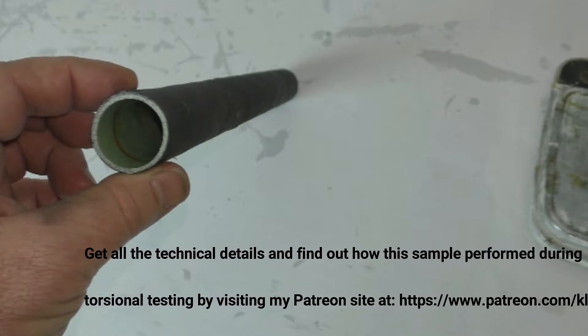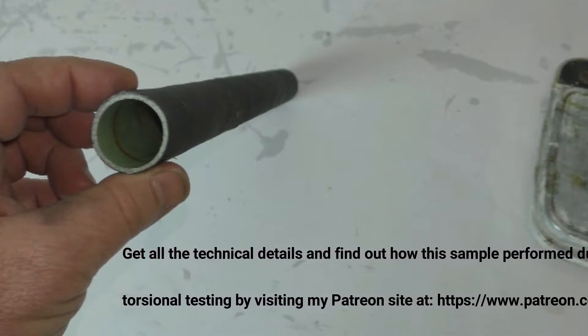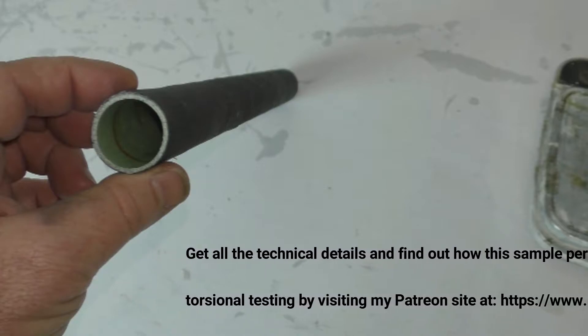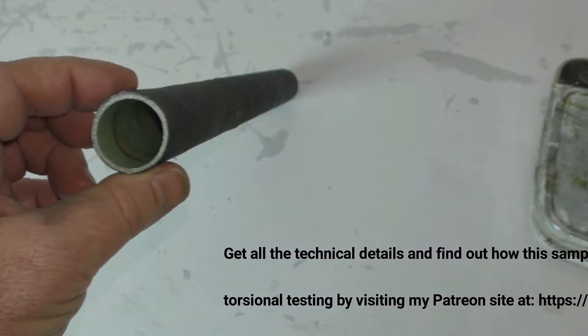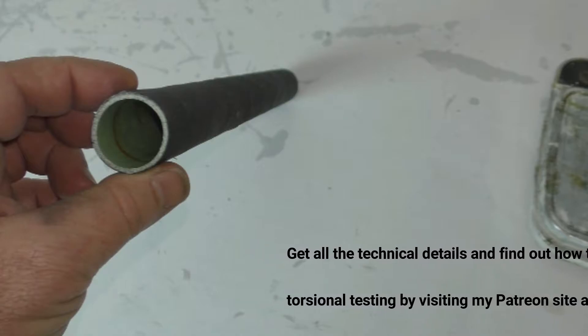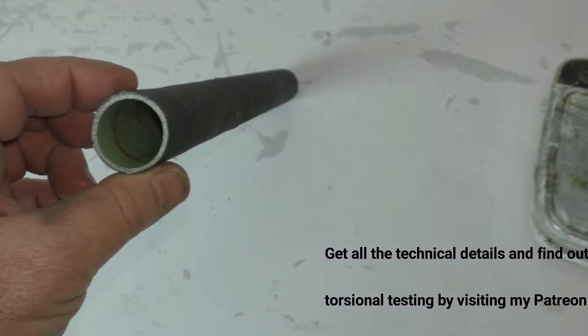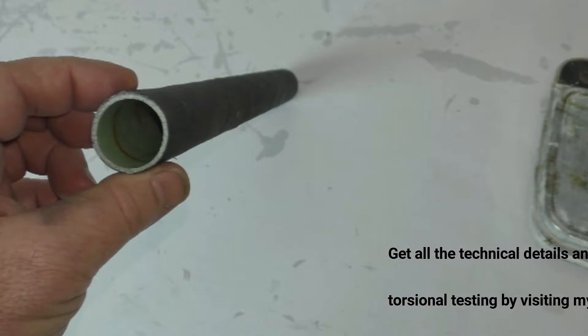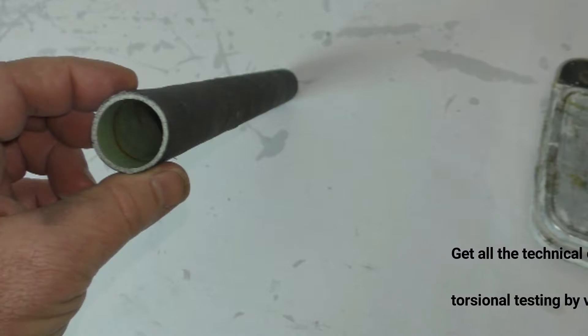In the fast-forward video you're going to see me lay down the fiberglass on the mandrel, over wrap it with the foam, then wrap with the carbon fiber, and at the end wrap it with some peel ply and heat shrink plastic. It's basically the same process I use for making standard composite tubing. In a few days I'm going to be posting detailed videos on how you actually create composite tubing — how you can make it on a straight section of aluminum tube and still remove the part when you're done.